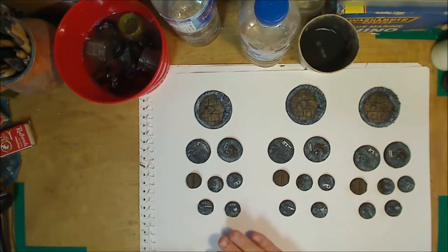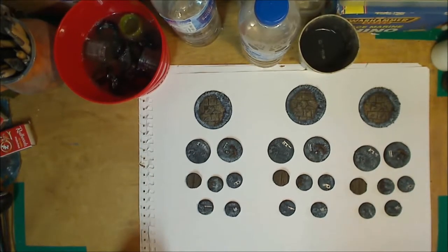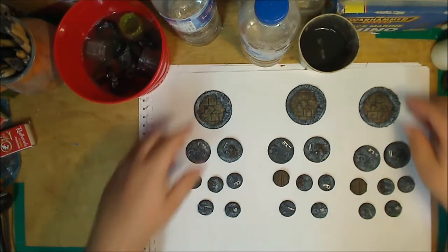I did use a very, very cheap, low quality resin that I just bought from the hardware store. I have no idea how long it was sitting on their shelf for. It could have been a few years old. When it was mixed up as well, I'm not even sure they had the correct catalyst for it, because it was a different brand of catalyst for the resin. So I believe that's probably why it's resulted in not capturing all the detail as well.